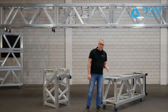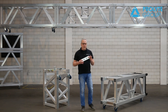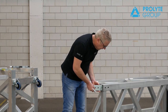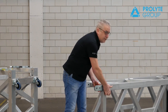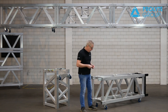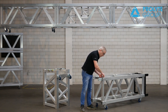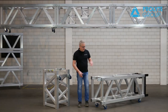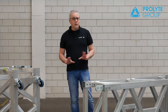Looking at the connection system, you will see it's not a conical coupling system — we use locks to connect the trusses to each other. Each lock contains four holes. You put your lock inside and then insert the locking pins, which can be placed in by hand. The locking pins are secured with a safety clip, which prevents them from coming out. The overall height of the truss is 69 centimeters and the width is 55. This truss is calculated to a maximum span of 45 meters, which is quite huge.